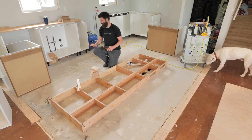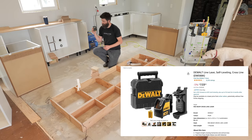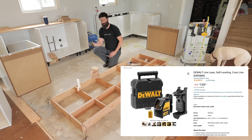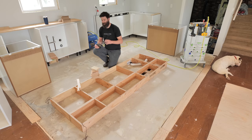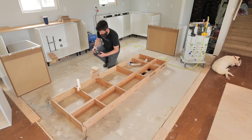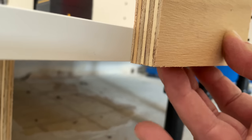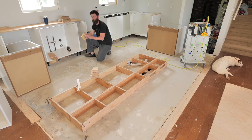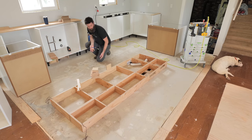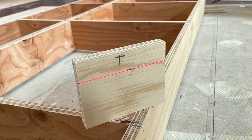You can use a four foot level, but the best thing is going to be a laser level. In my opinion, the one I'm using is the best value — not that expensive, and I'll put a link in the description. The way you do this to make it a lot easier: set your laser level up on the outer cabinet, take a scrap of plywood, put it to the bottom of the case, flush it up with the bottom of the case, and then pencil on where that laser line comes in. Now you've got a mark — raise the kick up till it's back to the same mark and you're going to be the exact same height as your outer cabinets. That's the easiest way I've found.